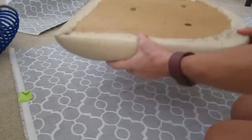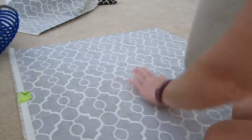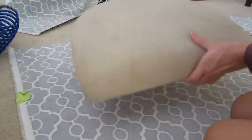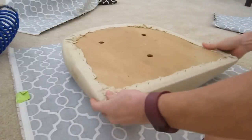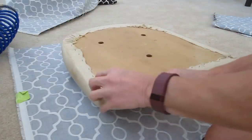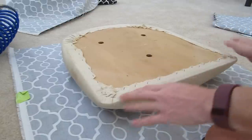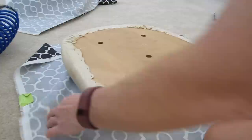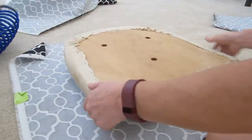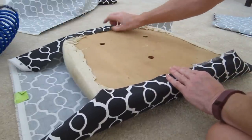Now that my pieces are cut out I'm going to go ahead and upholster. When you look at the chair cushion, remember which side is the front and which is the back — on some patterns you want to make sure you put it on the right way depending on the look you want. I also like to identify where the chair frame attaches to the seat and try not to cover those holes with fabric. On this chair there's one here, one here, and one on both sides. When I wrap the fabric I want to make sure I know where those holes are so I don't put a staple into them or cover them up, since they're harder to find later.